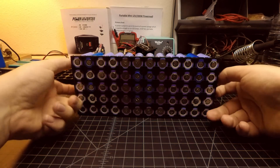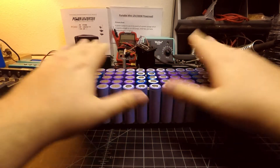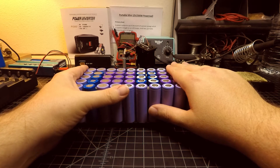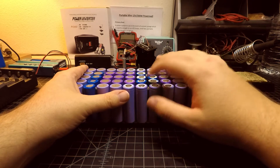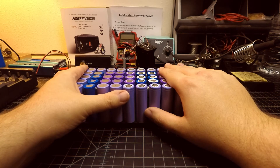We'll take a closer look at how I construct the wiring for this battery pack, because I don't plan to use copper bus bars. I plan on using 14-gauge silicone wire with fine wire fuses on each cell, both positive and negative side. I'll give you guys a closer look on how I actually do that.